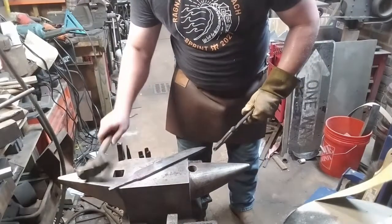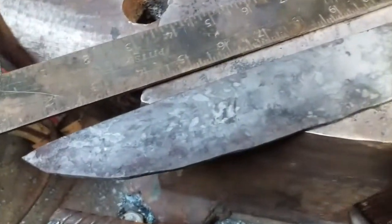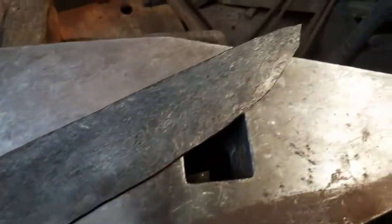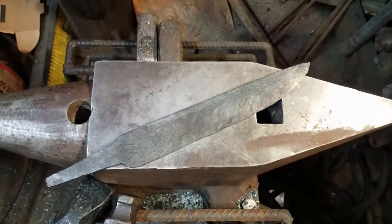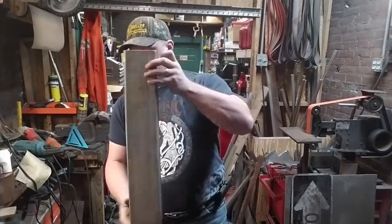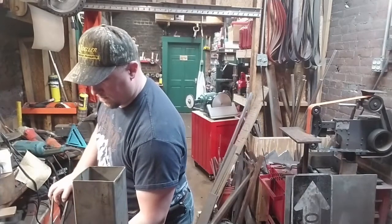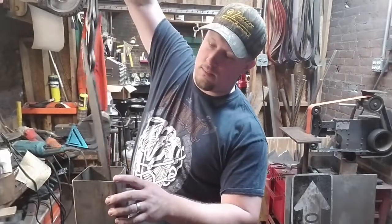And I think this particular blade just turned out beautifully. I'm very happy with it. Beautiful pattern welded Norwegian Seax blade, although you can't see the pattern as it is right now. It's covered in fire scale. Fire scale is, well, it's one of the mechanisms of decarburization, actually. And it's very abrasive. It's hard on your files. It's hard on your grinding belts.